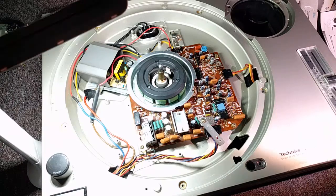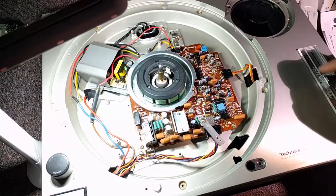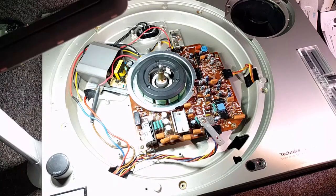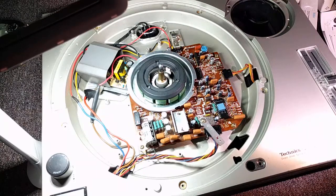If I'm doing an Arduino to fix the latch, I might as well do one that can also turn off the LEDs. This LED is driven by a voltage that's required for the fader, so I'll have to run a separate wire over to the microcontroller — that shouldn't be a big deal. As far as communicating with the microcontroller, I guess I could install an NRF solution, although that might be a bit much. I've got a lot of LEDs here to work with for different solutions. I also want to do a hall effect sensor to shut everything off when the tonearm reaches the label area — towards the middle. That would have to be calibrated per record, probably, depending on the groove. It's a thing to think about.